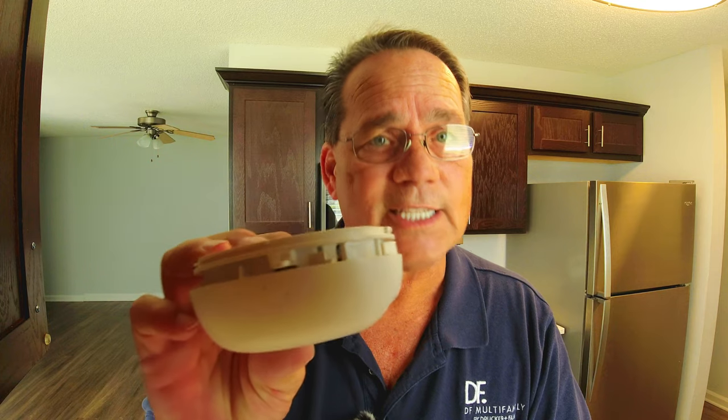I don't want to be the reason for somebody getting hurt or, heaven forbid, killed because a smoke alarm failed. So it's very important — change those smoke alarm batteries, blow them out, clean them out, and make sure they're within the date range. Smoke alarms have date ranges on them. They're making new ones with lithium batteries that last ten years; standard ones are about five. If you're exceeding that five years, go ahead and change it out. This applies to homeowners as well — put yourself on a regular schedule to change the battery, blow it out, check your wiring, and make sure it's functioning properly.